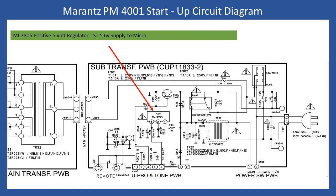As an engineer, I'm never a great fan of jacking up the negative line on pin 2 of the regulator. I've seen other Marantz amplifiers where this regulator has gone short circuit, and the resulting excess voltage has destroyed the microcontroller. There is no additional protection circuit — you can't belt-and-braces everything. Those boards and microcontrollers are no longer available, so in some cases this can render the amplifier beyond economical repair.